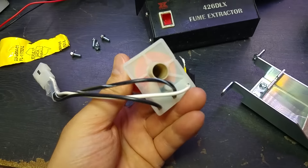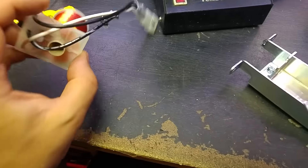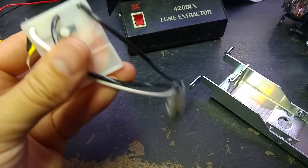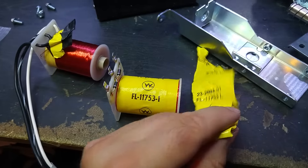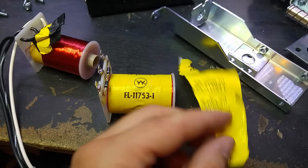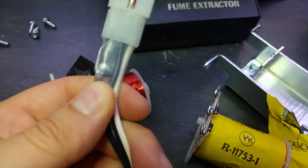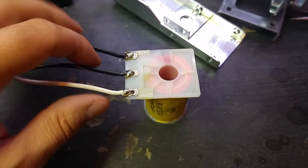You can't really see it very well but it's blackened inside the middle, and this sleeve is well and truly melted in. This is a non-standard coil — the wires go through and basically join straight onto the coil wires. The replacement coil sent under warranty is a Williams FL11753 flipper coil. Jersey Jack pinballs are basically rebadged Williams parts. To get this to fit, I'm going to have to cut the tabs off and also cut the diodes off, since the diodes are in the connector on the Jersey Jack one.